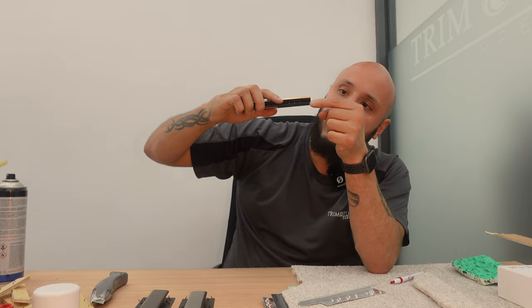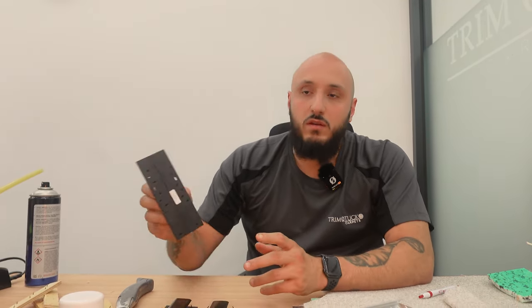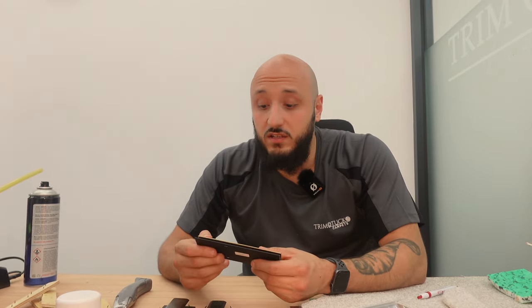Also, Gripper Rods do bars that are already pre-raised - the aluminium part kind of lips down and it's pre-raised, which is pretty helpful. The only problem is it's raised to a certain fixed height, so you can't really adjust it for different underlays. But it is very helpful and it cuts down the faffing around of cutting and raising pieces.